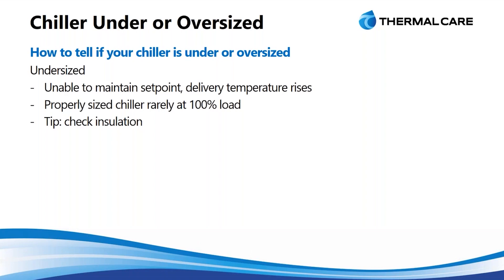With that gain of capacity as we increase the set point, that's really referring to what the chiller is actually producing. I could have it set at 50, but if I have a requirement for 10.5 tons, that temperature is actually going to rise up to about 54 — as we saw from the earlier slide — where it gets over that 10.5 mark at 10.65 tons. Once you hit that, it's going to find an equilibrium. So you have it set at 50 but it can only achieve 54 — you then know that chiller is slightly undersized.